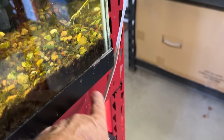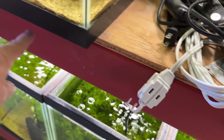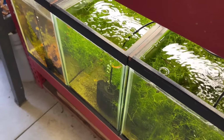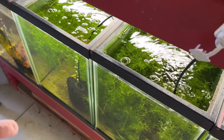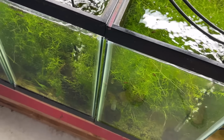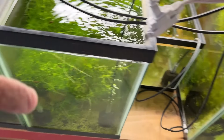And on this one, same thing. We're going to come out here, go down, valve down here, and it's going to go down this way and connect to this hose. Then we're going to do the same thing down below, one out of each tank, out of each one of these 5 tanks. It'll come up and out and go down to the rack. There will be a valve at each tank, so I can control each tank individually. And the drain line will all connect.